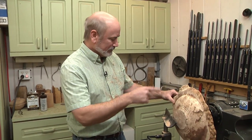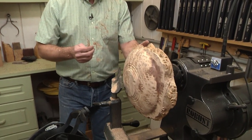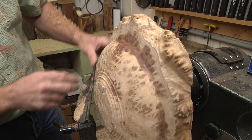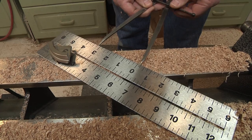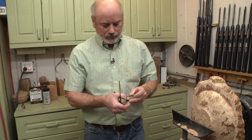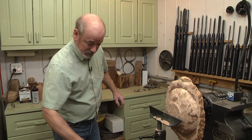That's what's so exciting about working with burls — just something always pops up. What I want to do is turn my recessed tenon on this end. Since this is really thick, I don't have to turn this other side. I'm looking for three inches on this, because the expansion distance on these jaws is a minimum of three inches. So I write that down on every one of my jaws — I write down also the minimum tenon size too, so I can remember what I need to do each time.